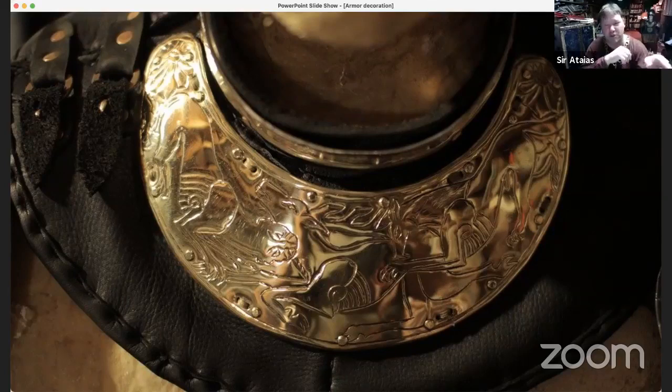However, the advantage of working on something like pitch is that I've already got it on that curved surface. I'm working it in one way, and the pitch is allowing it to deform the parts around those lines so that it gives it a kind of relief, where it actually allows for some shadows and stuff like that around the lines and the middle bends so it gets curves to it. Around those lines. So rather than just like this, it's more like this.